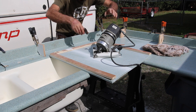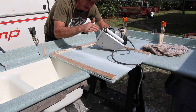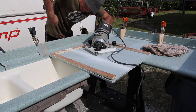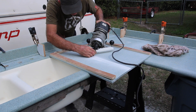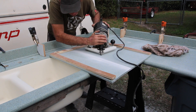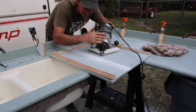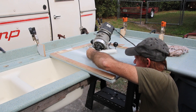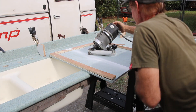While this is setting up, let's get our router ready. This is a specialty Porter Cable router — it has a half-inch coving bit, kind of a round bit on the end, and it has Teflon so it'll slide real easy, so we can put a rounded cove right here and it swoops up the backsplash. We need to test it on a piece of scrap before we put it on this new top, because if the bit isn't adjusted right it'll just dig right into the piece. We want to make sure it's not rubbing and that we're right on it — not too high, but certainly not too low. This is a specialty router; I don't use it for anything else.